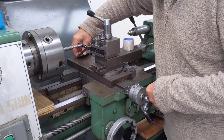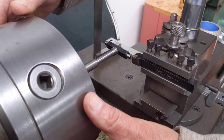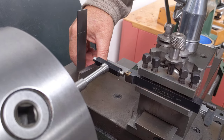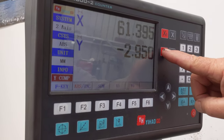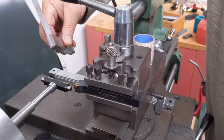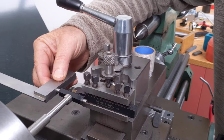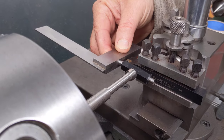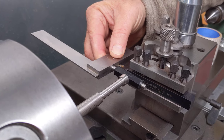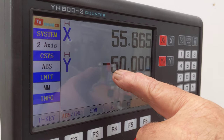So I just touch it on the scale there. We touch it there on the scale and then go up here and hit the red Y — so that's done that one. And I'll do the rear aspect of it now. I'm just using my square, which is also my height gauge, and I'm just going to wind it in here until it touches. Just touching there now. Then I go up and hit enter. So the Y axis has been set.